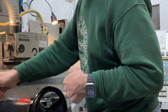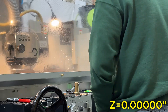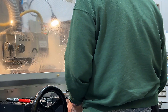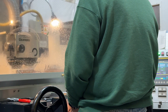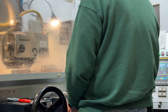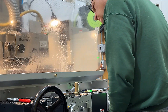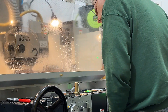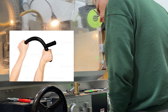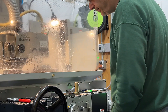Here we go — we're going to start the oscillation, putting up the shield, turning on coolant. Then we're going to simply walk the wheel into the part by two tenths, going as slowly as we can. Once we get to the end, we'll stick around and let it spark out. It's extremely important to note that the spark out on side wheeling is way more important than when doing normal perpendicular grinding — because the wheel is a big piece of flexible material. Everything's rubber, everything's pasta. The wheel bends much more when you're side wheeling, so the spark out is more important.